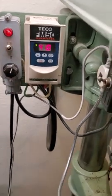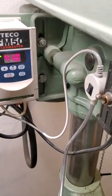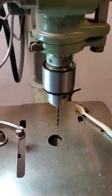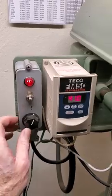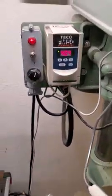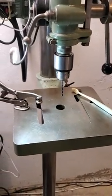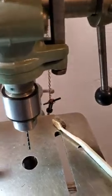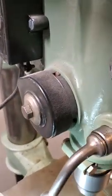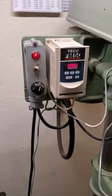Now, they say at low speed you lose a little bit of torque with the VFD, but because I've gone from a half horsepower to a three-quarter horsepower three-phase motor, I've got plenty of power for anything I want to do with it. It's a nice upgrade — kind of a resto mod, you know, take something that's 70 years old and put some modern electronics on it to give you variable speed capability. I've been using it ever since I restored it and it works flawlessly. It's really a nice way to have a good American made drill press with the modern capability of infinitely variable speed.